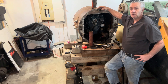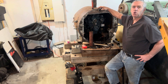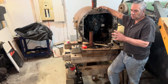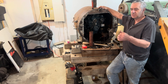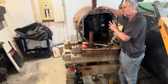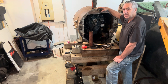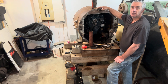It's really turning into a nice conversion. It's also going to be quieter — it's just a much quieter diesel. With the Yanmar I had my own coupler system running off the front harmonic balancer, and I wasn't overly thrilled about that. Now I have the proper bell housing with the pump mounted to it and the rubber coupler — all Kubota stuff — so it'll be nice and reliable. That's it for today, that's my progress.